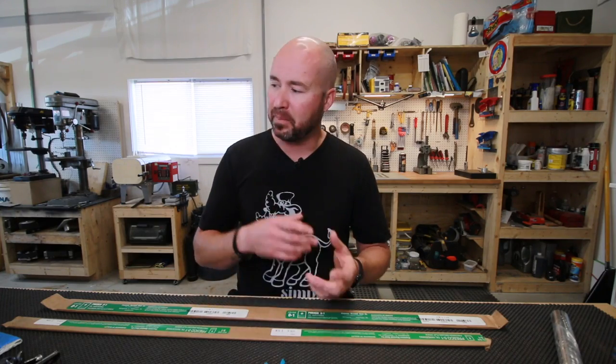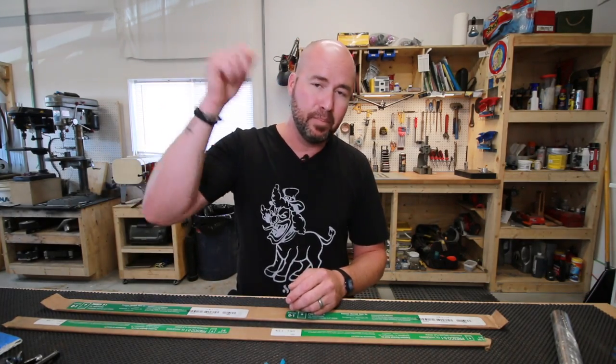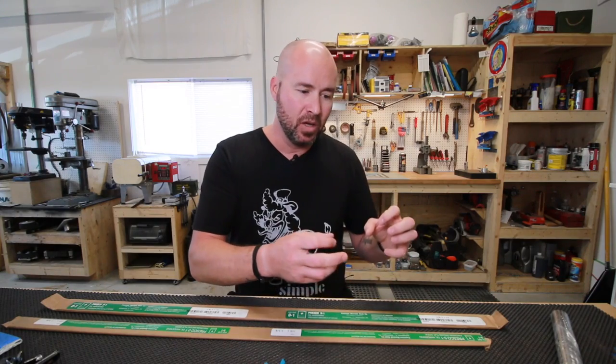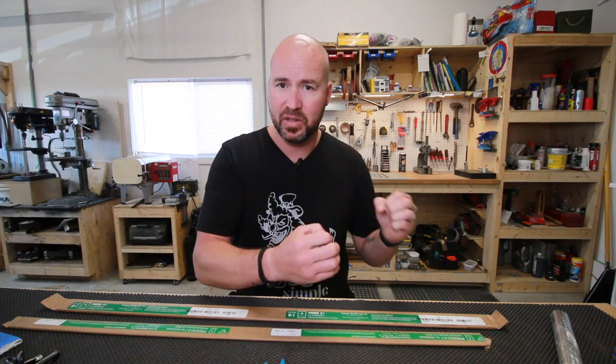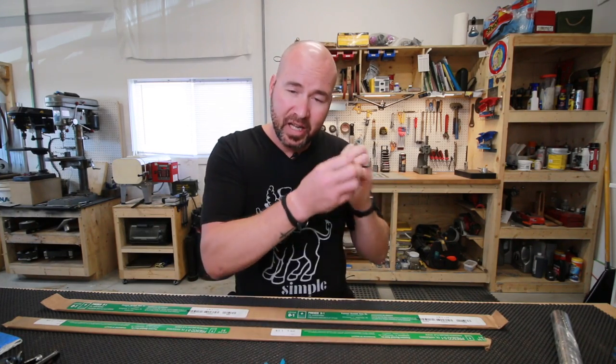The other thing with stainless steel, some people say that you can do some oil quenching, and I haven't tried enough to say one way or the other, but my thoughts are this. When I think about a little bit of theory behind it, if I take a piece of steel that's 2000 degrees Fahrenheit and put that in oil, instantly it's boiling, right? You're boiling all the oil, water, whatever it is around that blade. When you're boiling it, you're creating air pockets around it, and air is not a great conductor of heat. You're not removing heat from all those air bubbles around it. Those air bubbles are keeping it from the oil, which would suck out the heat better.